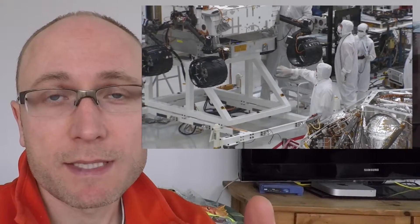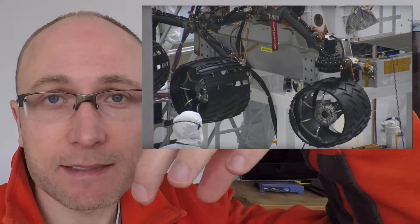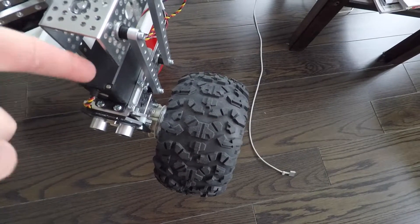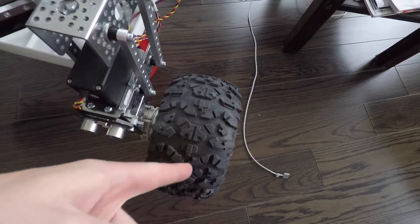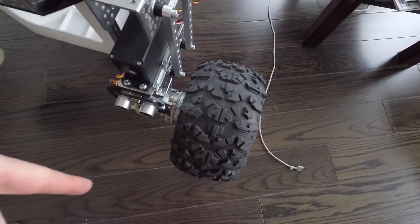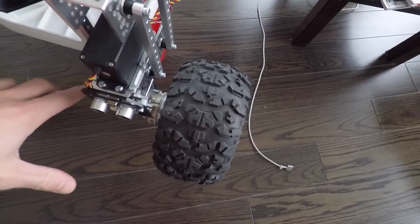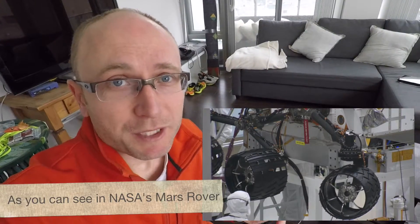The tire doesn't have to turn in a radius — it can turn on its axis. In Rover's case, however, if the servo rotates here on this axis, then this tire will want to rotate around in a circle, in a radius, as opposed to turning on itself. When I was designing Rover, I didn't appreciate why NASA went about it the way they did. Of course now I see their logic — they're NASA for a reason.